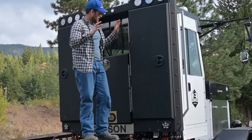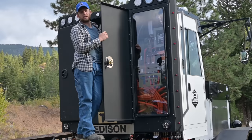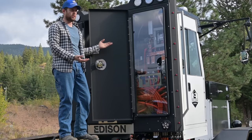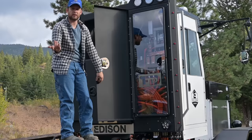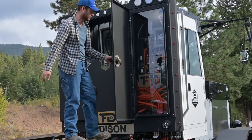One of the cool things about our truck is that this thing that looks like a headache rack is actually not a headache rack. Electric trucks need what you call a power distribution unit. We put ours in the headache rack, so it looks clean — it looks like it should be on a truck, because I'm tired of ugly looking EVs. This side here is all your contactors, your fuses, the safety equipment — this is what makes sure the electric system is safe. If there's an issue, it blows fuses and shuts itself down. This is the ground fault monitoring, all in this box.